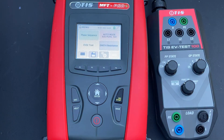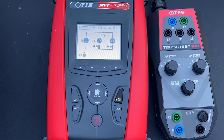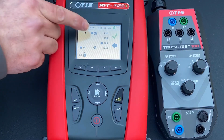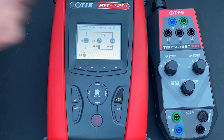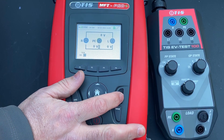On the third page you can see the EVSE test icon. We click on that icon and it's asking us to set up the EVSE charger installed today. We've got to select the ampere rating as well as whether it's vented or unvented — essentially whether it has a fan built in. We've set it to three-phase, non-ventilated, and 32 amps, then tick the box to confirm the EVSE is set up correctly.